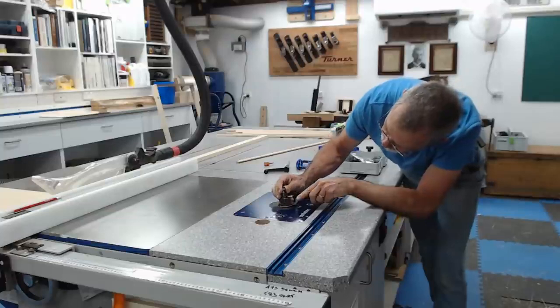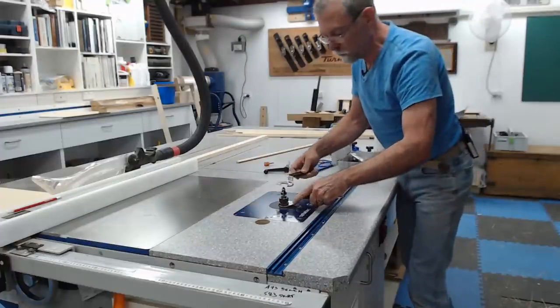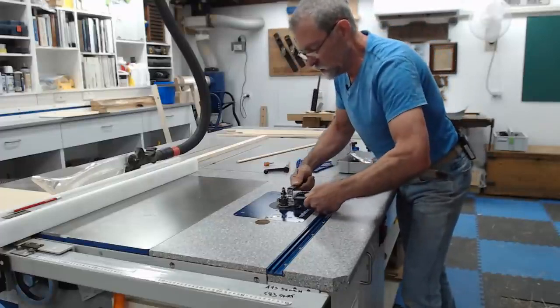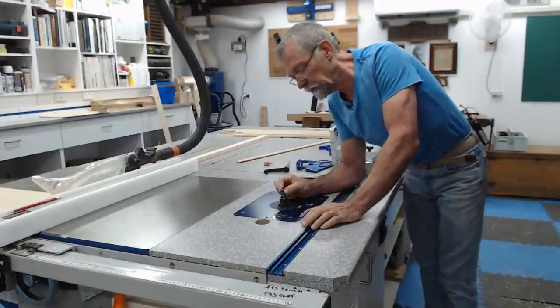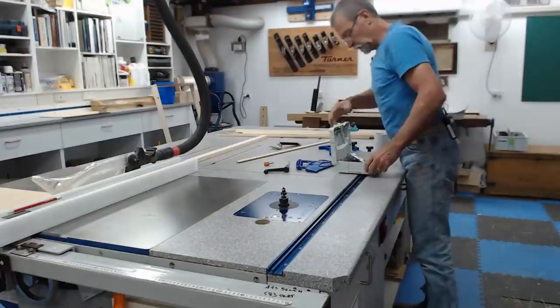And then I'm going to pull this cutter up just a little bit because it's got the K-line there. I've explained what a K-line is before. There's a little line on the cutter that says that's where it needs to be in the collet. That ain't going anywhere. Cool.